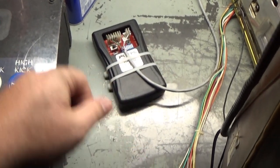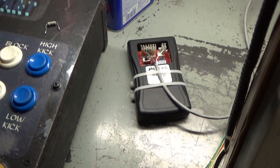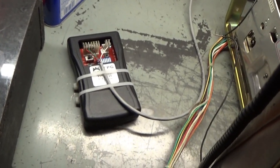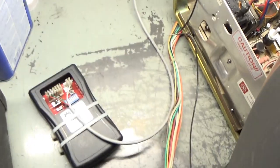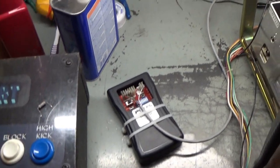I found nothing else wrong. This has to be it. Oh, ha ha ha! Success! There you go. Bad resistor. Bad R120. Look at that. Of course, this looks like utter garbage. Where's my remote board? Okay. Brightness and contrast completely down.